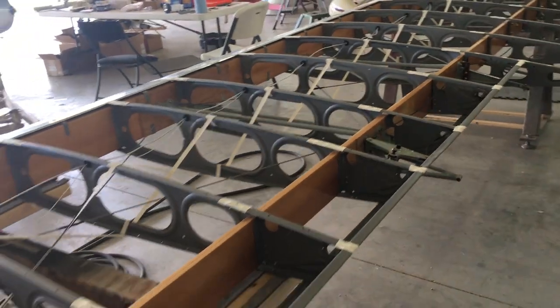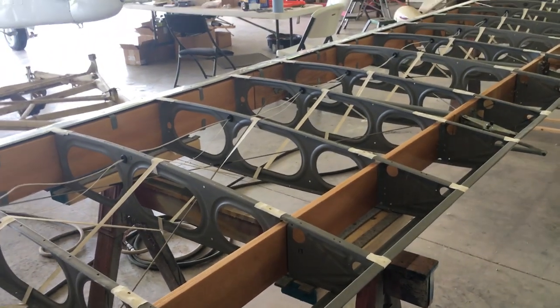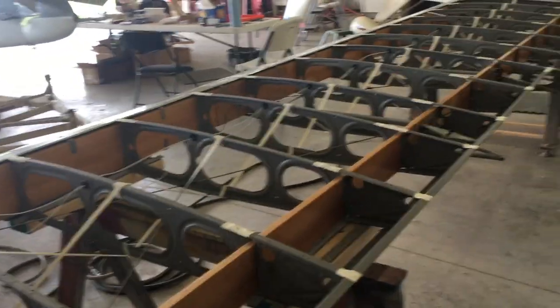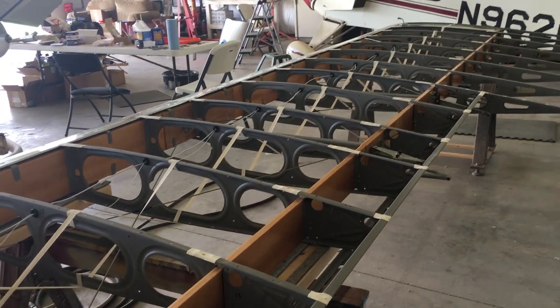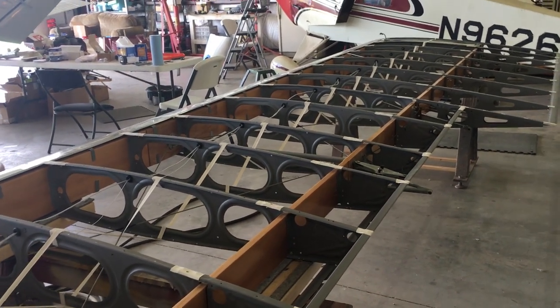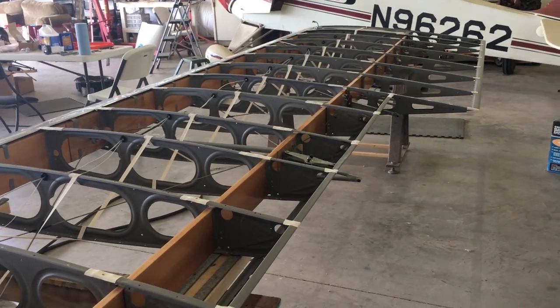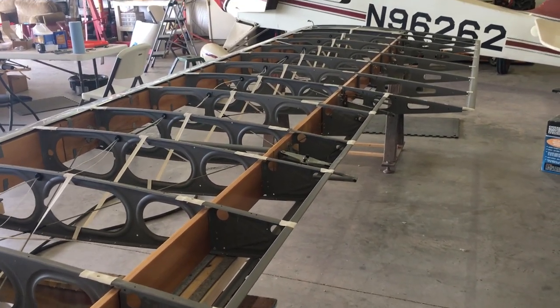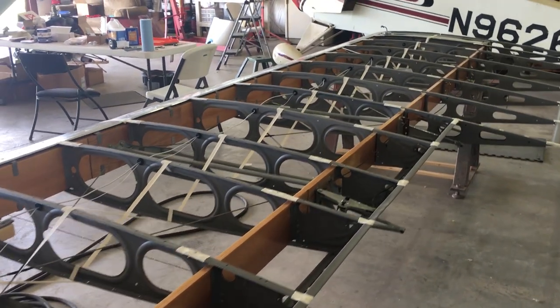And once we have the spars and the ribs all connected together and the wing structurally built, then we put something over that surface. More modern type aircraft are going to have an aluminum skin that'll be riveted to those ribs. But the older and even some of the newer aircraft that are more bush plane style still use a fabric instead of aluminum over these ribs.